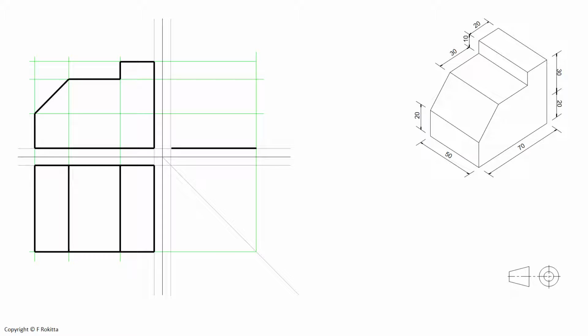We will start the left view's baseline at the bottom from the anchor point and make sure that it is at a depth of 50 mm. Then we will continue to draw the layout of the outline of our side view. We also will fill in the solid lines that represent the corners of the surface seen from the left.